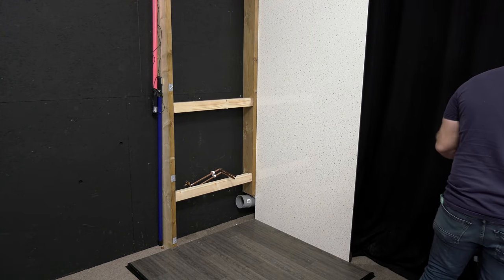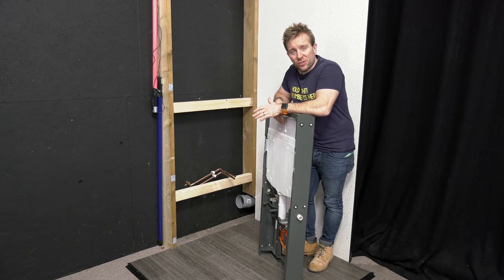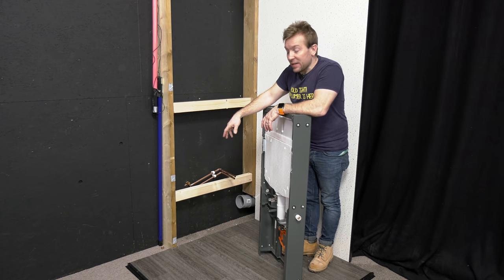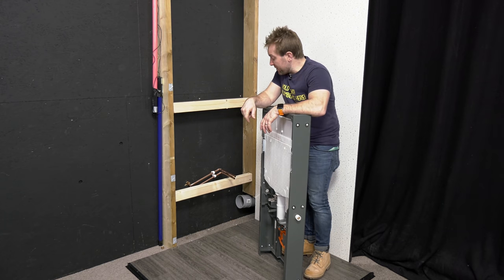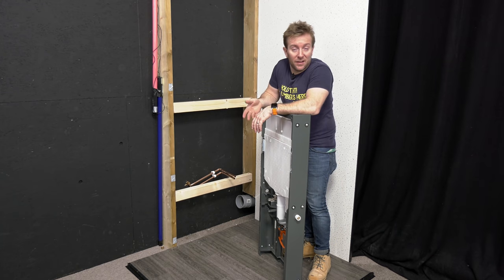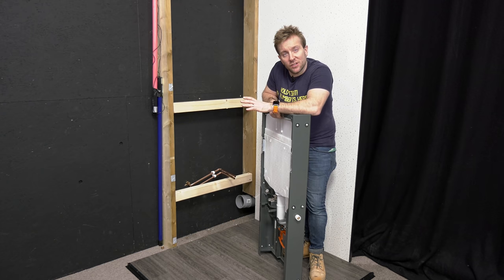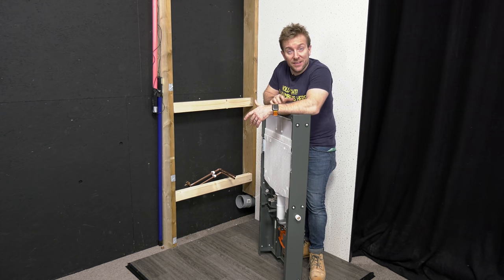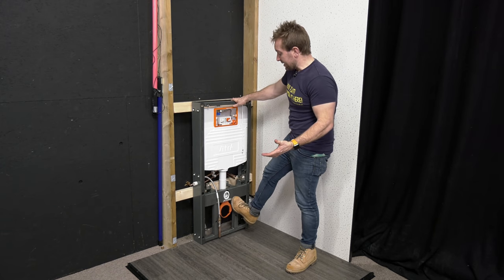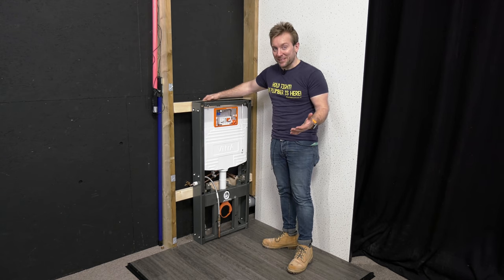Here's the piece here — you're gonna love this so much. Now I've already first fixed my hot and cold in. The reason I've done hot and cold is just because I wanted to show you that you can get them in there. And if you wanna put a thermostatically run and regulated bidet in, like the wall-mounted valve that we did in the previous middle bidet video, all you need to do is replace that with the thermostatic valve set — I've left the link to that below. So what I'll do in this video is we'll just show you how to do the cold side of that. It's a very simple job, and for a lot of you DIY gang out there, you're gonna love it because all it is, is effectively you're gonna bolt this to the wall, bolt this to the studding. You haven't really got much more to do when it comes to the plumbing side of things.